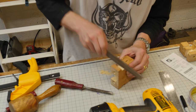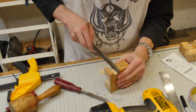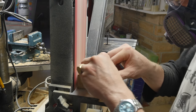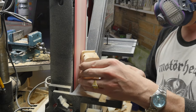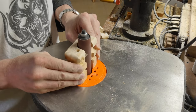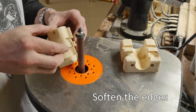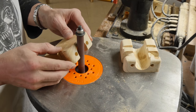To smooth out the little radius for the handle, I use a file — actually a metal file, since I don't have a nice square wood file. Then I take everything over to the belt sander to radius things off and make it a little more human and softer so your hands aren't rubbing against anything sharp. For the thumb area, I take it over to the oscillating spindle sander and radius off those edges.